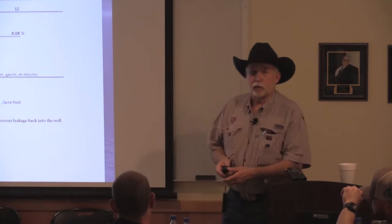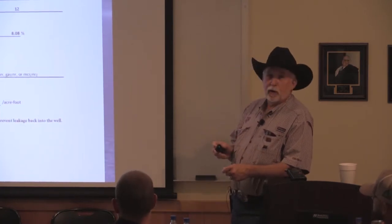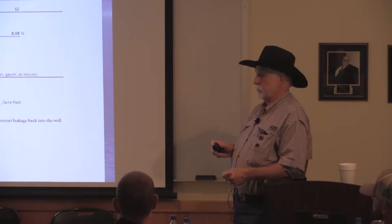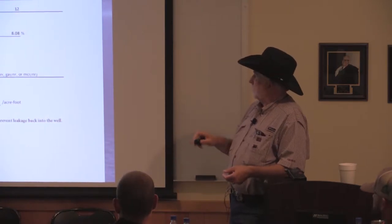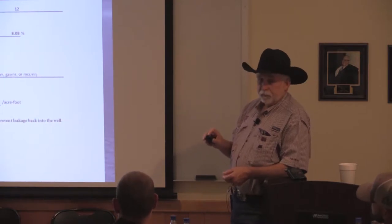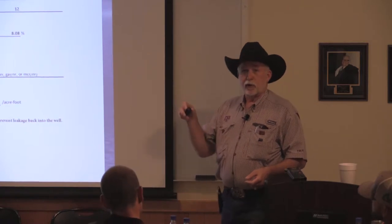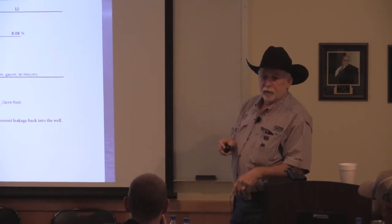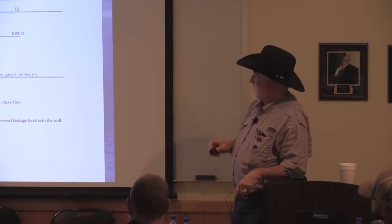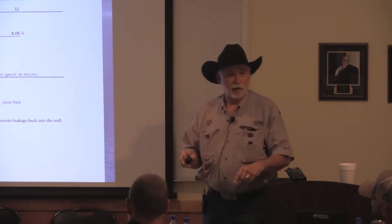$551 per acre foot is what that well was costing to run. And he had no idea, no idea. The pump efficiency was 8%. I don't usually do this, but when I tested that well, the first thing I did was turn it off and close the gate valve. In fact, that was my recommendation.